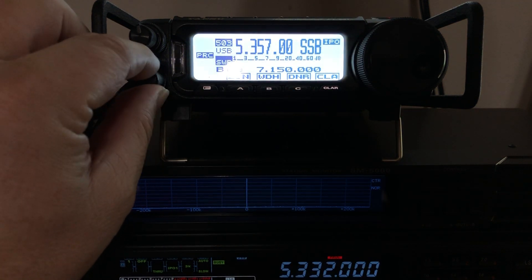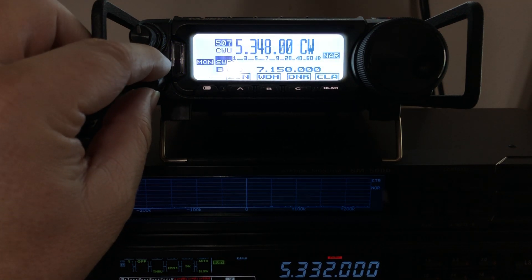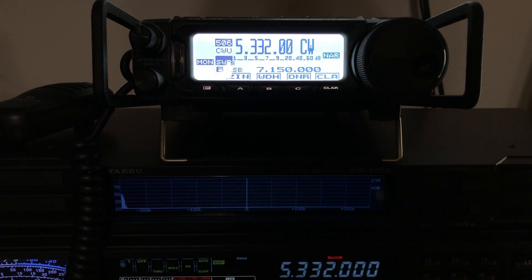You'll notice here, beginning at 501 and going up through 510, the FT-891 from Yaesu comes pre-programmed with those channels and you can't change it. On older rigs this would not be available without a Mars mod, and you've got to be careful that you're operating on the correct frequencies. If you're programming them into memory, make sure you get everything set correctly. Just remember: if you're modifying an old radio, be mindful of your transmit bandwidth and don't exceed 2.8 kilohertz.